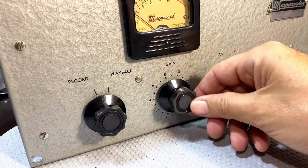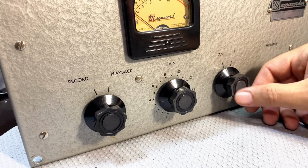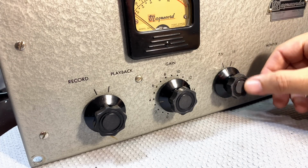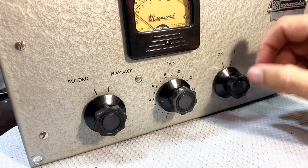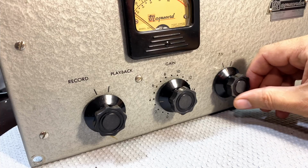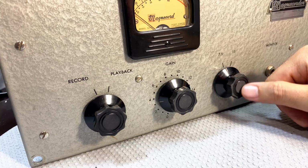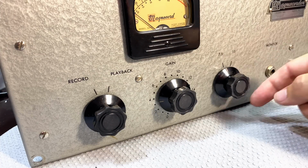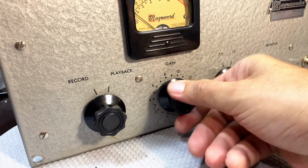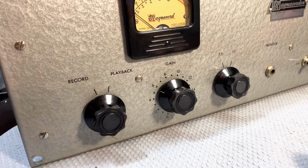And the knobs, well, this is sort of a Bakelite knob. Because the damage was only on the external surface, I got some wet and dry sandpaper, very, very fine, I think it's like 1200 grit or something, and just gently polished this. I didn't get a shine back. I don't really want to. I think it looks great like this, and they now look totally uniform. Obviously the rest got cleaned up, and we've got ourselves our knobs. And everything is hunky-dory. So that was the cleaning of the faceplate.